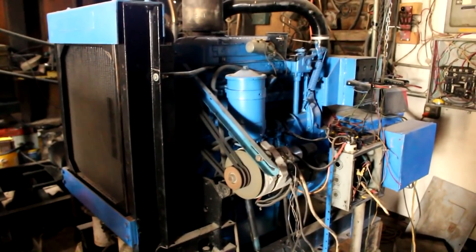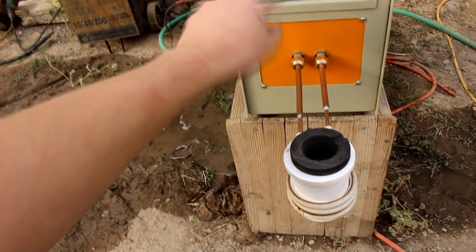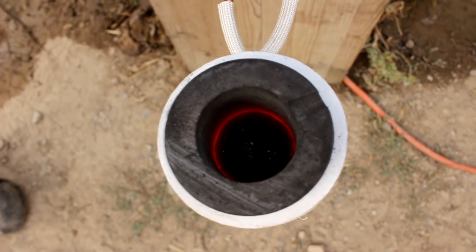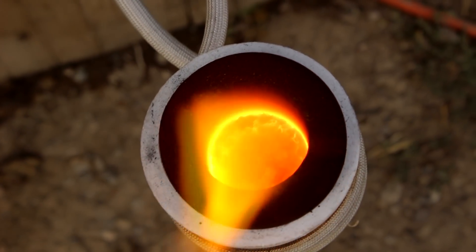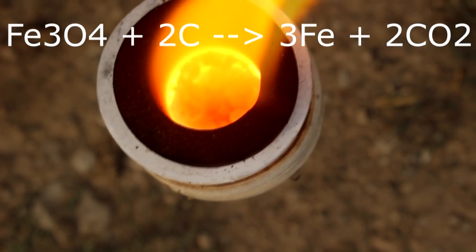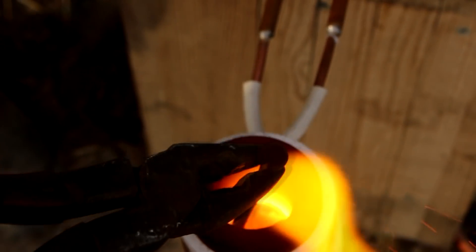Here's the data plate — you can see it's a 20 kilowatt generator, up to 62.7 amps on multiple phases. We've got our cooling water spilling out. We've got 260 amps oscillating at almost 100,000 times a second. This thing will get warm real quick. There we go — it's getting red hot. It'll be white hot by the time we're done. Now we're cooking. You can see the carbon dioxide coming out as the iron oxide is reacting with the carbon. So it is making iron metal. The question is, will it be liquid or will it be a bloom? Maybe if I poke at it a little bit and stir it, I can get the metal to come together into a single glob.